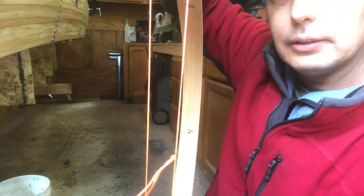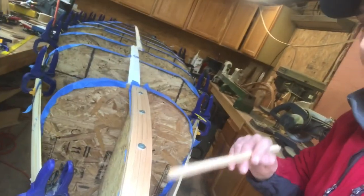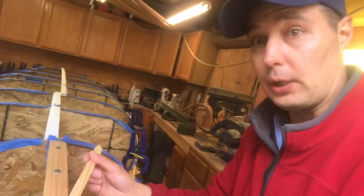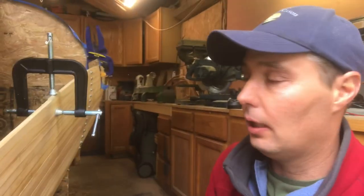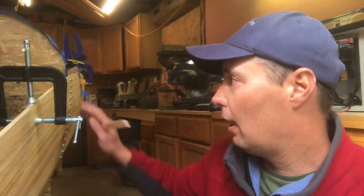So what I want you to do is mount your inner stem, string up and set aside your outer stem — remember we labeled it with an 'A'. Make your strips, start stripping. I only want you to strip up to where we are here, around this point, because in the next video I'm going to show you when the strips come across at the top the angle changes and they'll need to start mitering. I'll show you how to do that and how to allow for the inlay of the outer stem, which will cap over and flow into the hull.